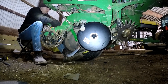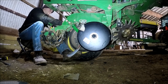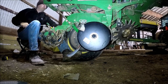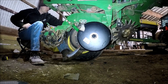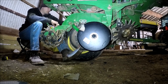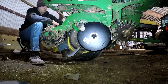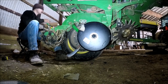Using my foot to get the gauge wheel up where I need it to be. That's why I waited until the last row to show you guys doing this, because if I had done this on the first row it would have been probably twice as long — and probably me throwing the stuff around a little bit more. Like that scraper that you saw me put in the openers — I was forgetting to do those, which was kind of frustrating. I had to go back; you can put them back on with just one wheel on by removing one of those gauge wheels, but it's annoying after you just went through and got everything set.